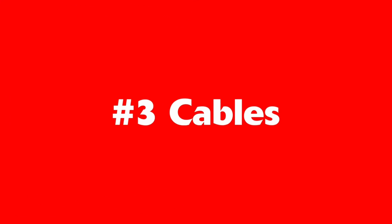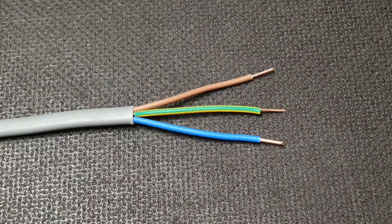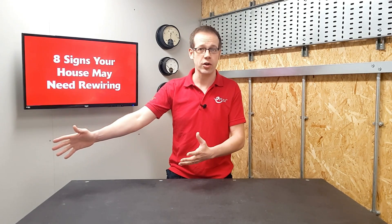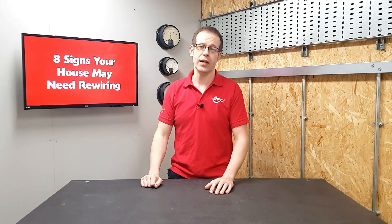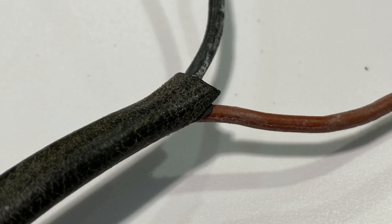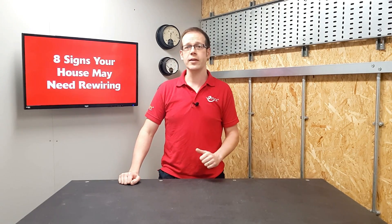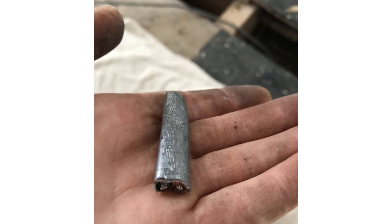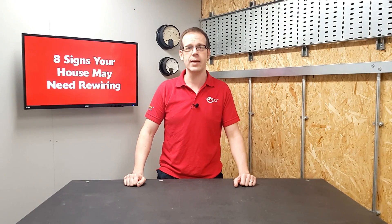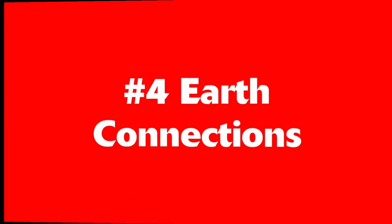If your socket outlets look a little older, yellowed, or damaged, that's an indication there may be old unsuitable cable behind them. Number three: cables. Nowadays we tend to install cables insulated with PVC with an outer sheath also made of PVC. Older installations used cables insulated in vulcanized India rubber, or VIR, and over time this insulation has a tendency to turn brittle and break away. You may also find cables with a dull metallic sheen — that's because this type of cable is coated in a lead sheath, and is also old and will likely need replacing.